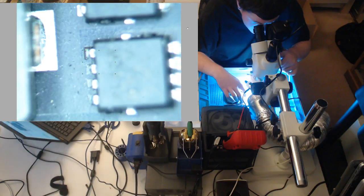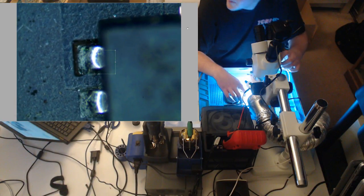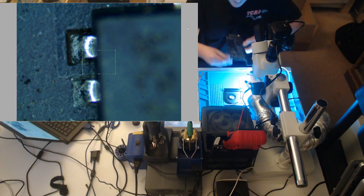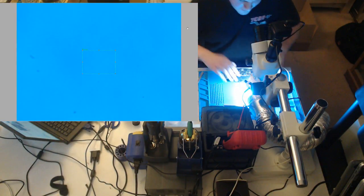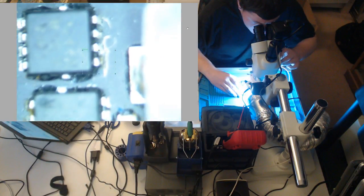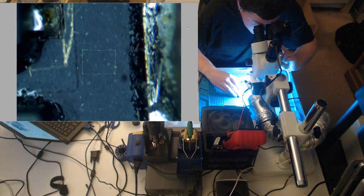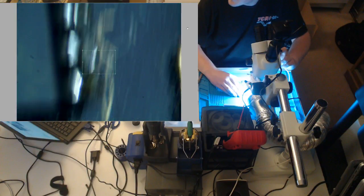And if that's the case, see, I can't tell if that's corroded. Let's look at the other board. See how that's kind of gone? There's a very good chance that our issues now are being caused by a dead CPU. So see how it's kind of gone around that pad? I'm not giving up just yet. Maybe not. See how this looks? No, I think that's actually okay. That looks the same on this donor board.